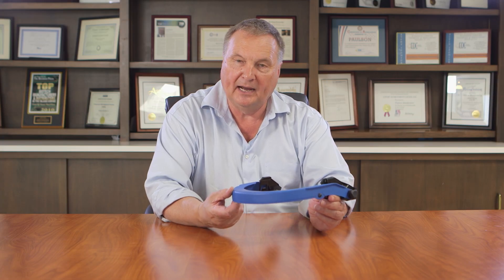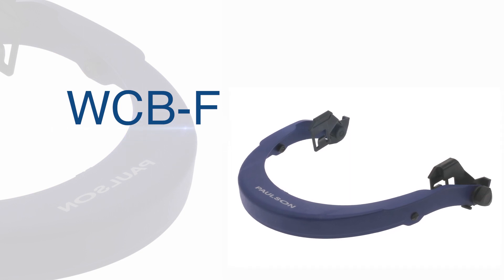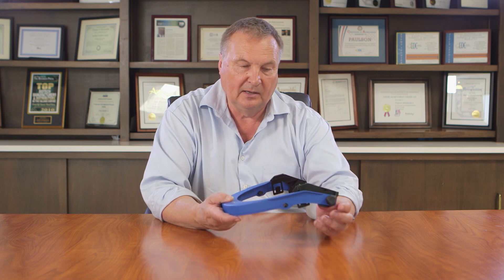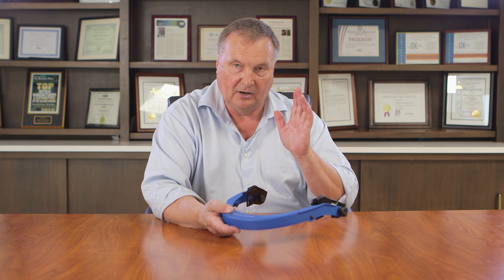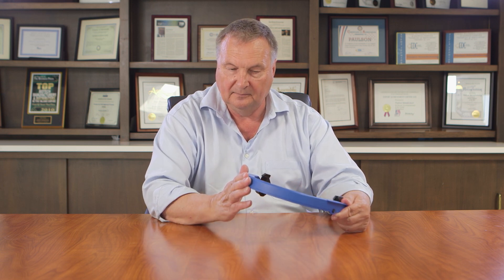This is the weight compensating bracket specifically for the fiber metal safety helmet. We have a unique attachment system right here that slides into the slots. It has the attachment for the face shield called the lever lock system — it snaps together without tools to allow you to change out and attach a face shield. You can see the up stop and the down stop so that the bracket doesn't over-travel and go behind your head. And you have adjustable pivots here so you can set the tension — whether you want to do the welder's nod to drop the face shield, or tension it tighter so you pull the face shield down by hand. We sell the bracket assembly separately so you can pair it with the face shield designed for your particular application.